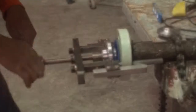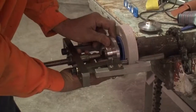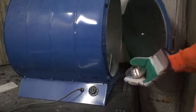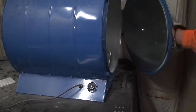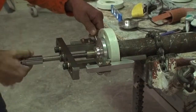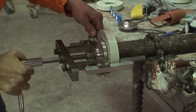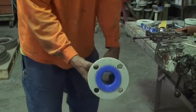Once the flaring cone has cooled, remove the flaring cone, place it back into the preheated oven and bring it back to its proper flaring temperature. This time, reinstall the flaring cone with the flat side of the flaring cone facing forward. Screw it forward until it bottoms out. Once cooled, remove the flaring tool assembly. Inspect the flange for any imperfections.